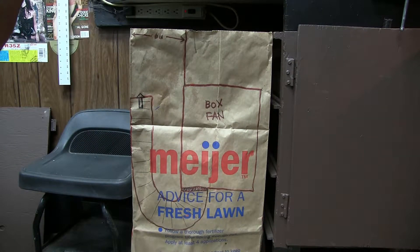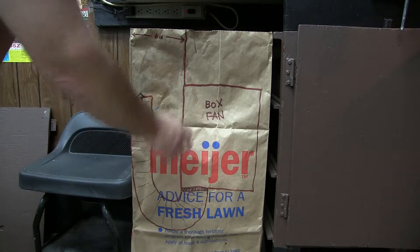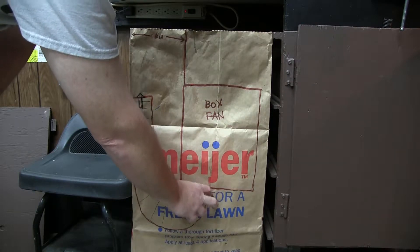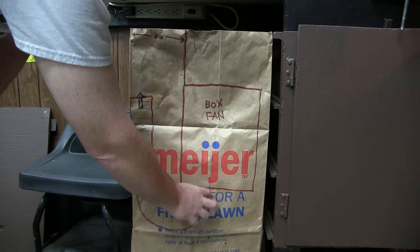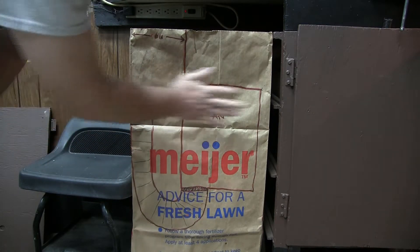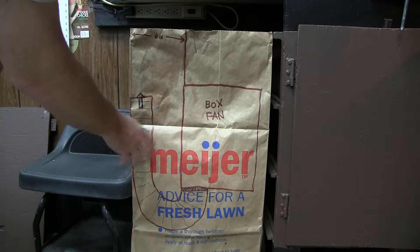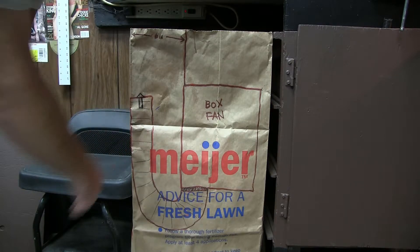I went up in the attic with the roofer because we were looking for the tubing coming out of the fan, and we almost couldn't find it at first. My attic has a lot of blown-in insulation. When we moved the insulation around, we found the box and could tap on it to confirm it was the fan box, but we couldn't see the exhaust tubing. As we cleared away more insulation, we found the tubing comes out of the bottom of the box fan — not the top — bends up in a U, then makes a jog and disappears into the wall. That's because there's a soffit built into my kitchen around the perimeter where the ceiling meets the wall, and that's what the tubing and the range hood exhaust both run through.